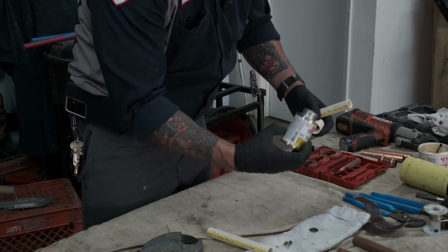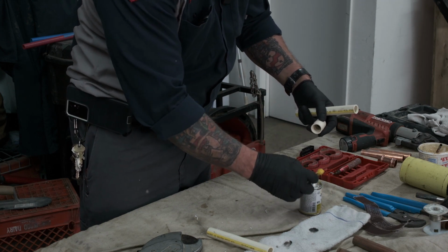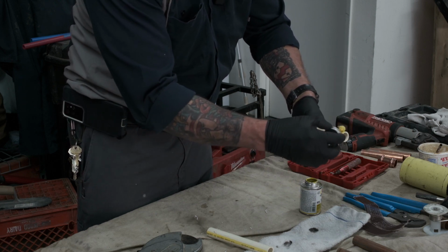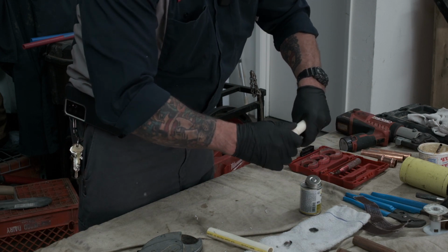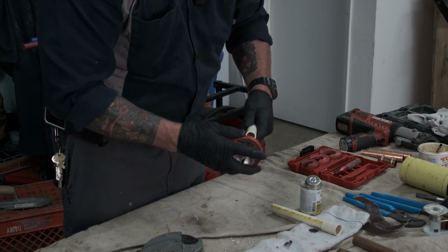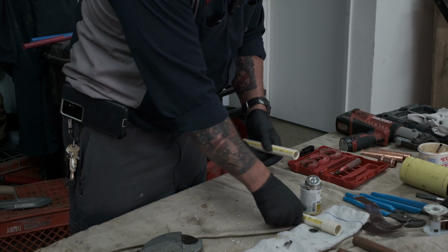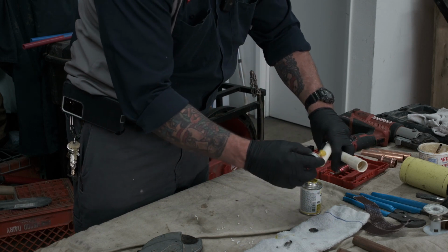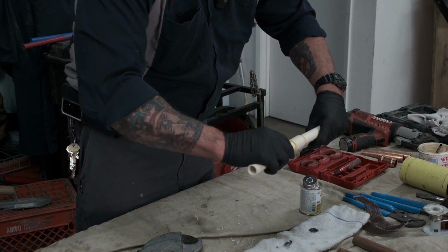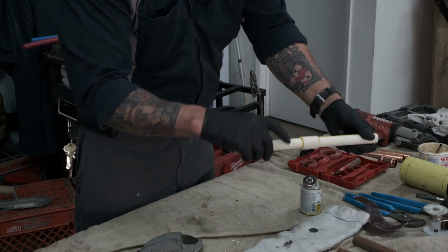If you have any questions about instruction on applications, the cans do provide it. And I do like to follow the first application with the pipe, the cup, a little bit more on the pipe, glue this in, okay? Let's do a little ream on inner and outer. With that application, I always do a little quarter turn to make sure that bead is spread. That's where you know you got your good seal.